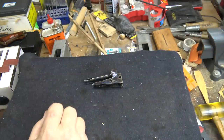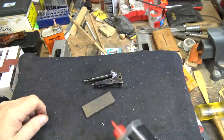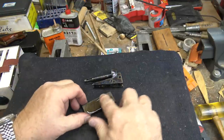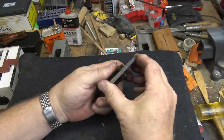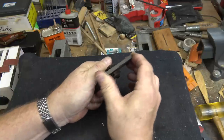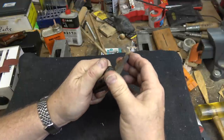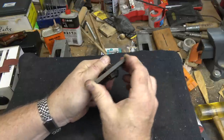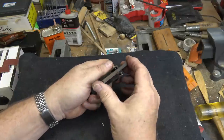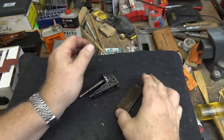For the frame work I like using this stone right here — just put some oil on it. I like it because it fits inside this area and keeps everything perfectly flat, so I don't have to worry about dishing anything while I'm polishing. I want to go over the entire inside of this slot on both sides and polish that out so we get the hammer falling freely. Then I'll do the same thing on the other side. The hand slot looks pretty clean but I'm still going to stone it a little bit with this Brownells hand slot stone to get any roughness out of there.